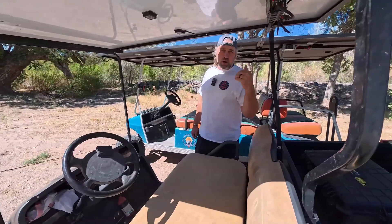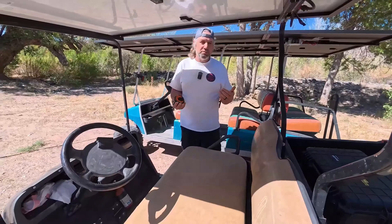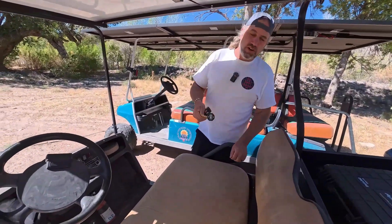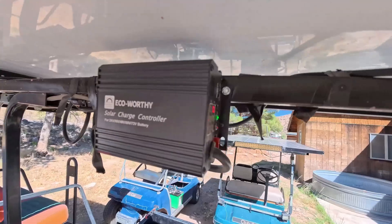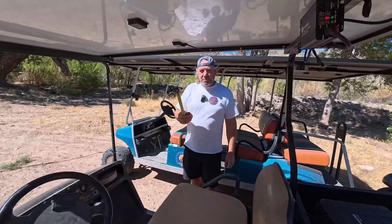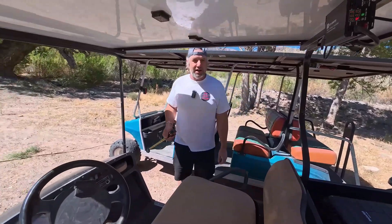You've got to determine the watts and the volts of your panels. Most panels nowadays are between 30 and 40 volts — pretty standard regardless of size — so you need a boost controller. This eco-worthy boost controller right here is good for 450 watts, and we've got a 380 watt panel, so that one works. I'd really like to put a 700 watt panel on a golf cart but I cannot find a boost controller that can handle that many watts.